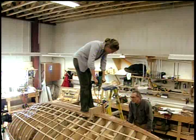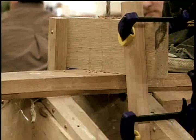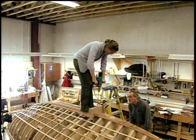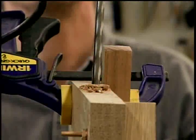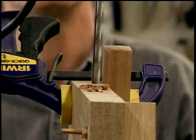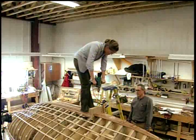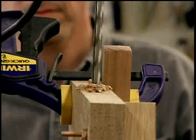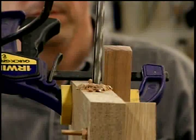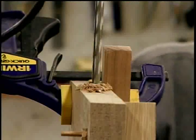She's working it up and down, and if she feels resistance, she works it back out of the hole to clear out the excess chips. The drill bit she's using is an 18 inch high speed steel drill bit — an extra long bit for drilling through long spaces. Same idea as the little short bits, just a lot more wood to go through in this case.